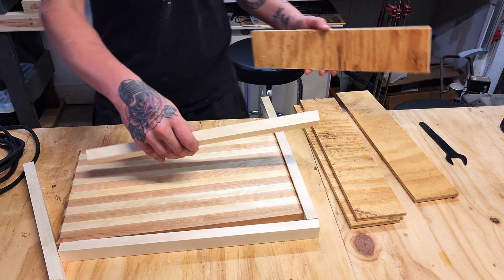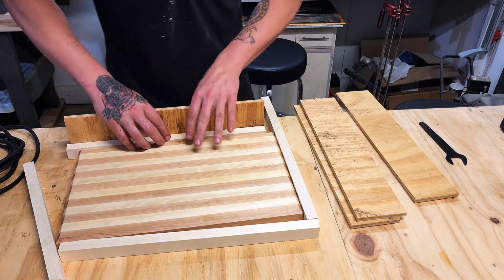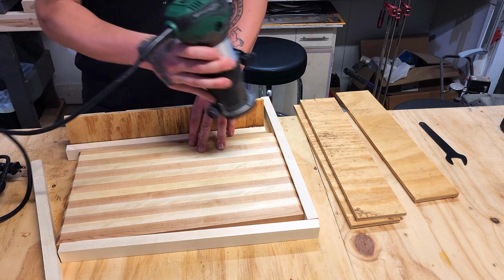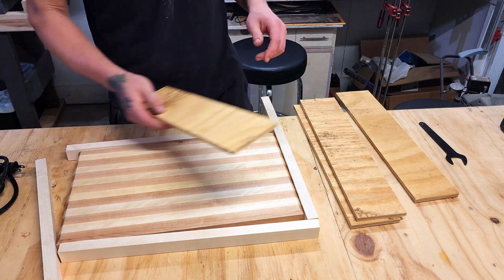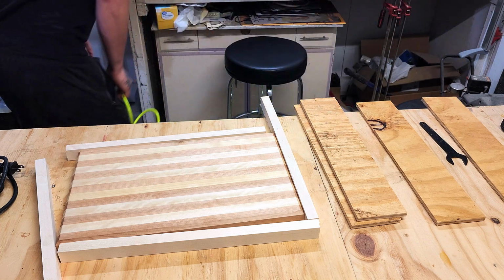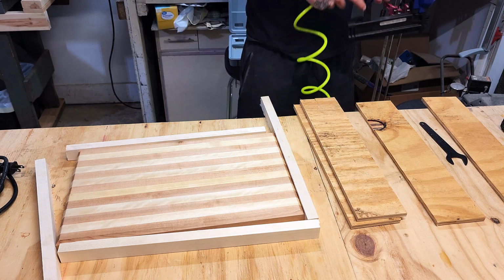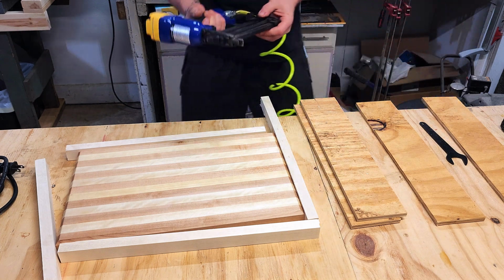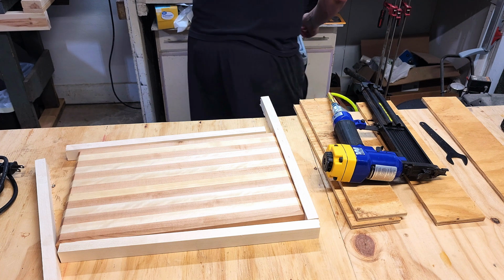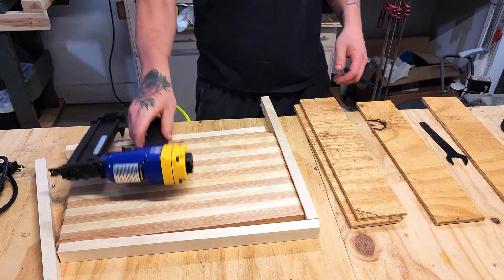Okay, I have my 3/4 inch wide spacers, and then I have my wall. I will fasten the two of these together, and then when I run this, it will guide me. Okay, so we just need to fasten these. I have 50 pounds of pressure in my air compressor, and I don't want to pump it up because it's loud. Let's see if I can get a little, oh, I got big long ones in here though. That's too long. Things would happen. I do have these. They're only 1 inch. Should be fine. Okay.